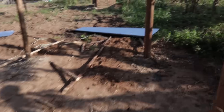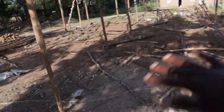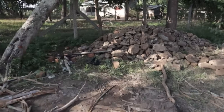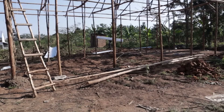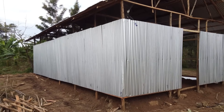Already today we're going to start the roofing, which is the most delicate or complicated work. You can see our iron sheets right here — we've gathered them, and we have more in the distance. After we finish the roofing we shall build around, and then we shall do the screeding — leveling and screeding on the inside. We're going to be leveling the surface using stones, which we've been ferrying with our tricycle. We've already put quite a number of stones in. So far we are done with the roofing, as you can see, and we are getting to complete the rest of the sides.